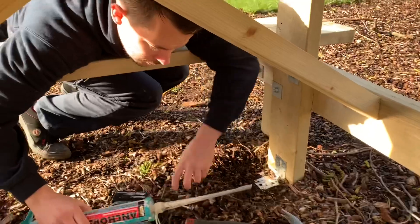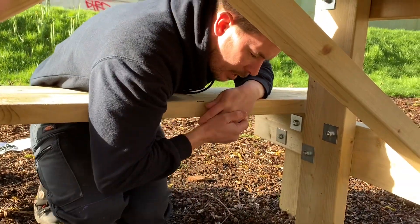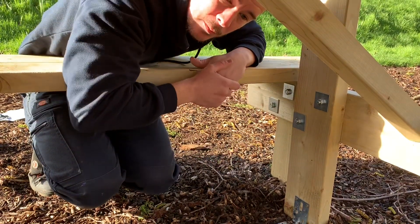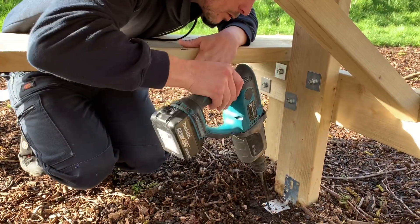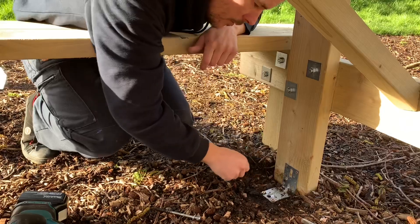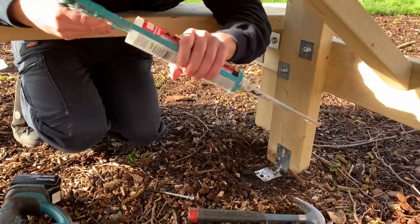We've got a situation where we've had a poor level of fixing underneath. We've got some chipstone down, but beneath that we've got some tarmac. The tarmac is old and there's not much to it, and beneath that is just hardcore. So what we're going to do is drill a nice 8mm hole — which we've already drilled — and make sure we get all the debris out so it's not fouling the bolt as it goes in.